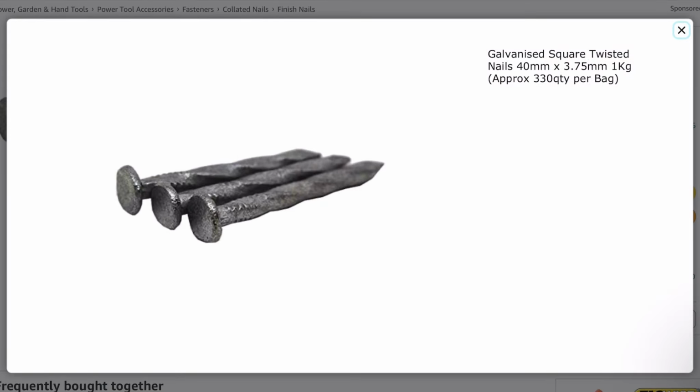The temptation is to look for easier solutions like these bracket hangers. They allow you to get the joists in place first on the frame and then slide the hanger underneath and fix it, making everything a lot faster and a lot less cumbersome on your back. However, the likelihood of you getting squeaky joists is much higher with this hanger, and I don't know why you would compromise on something so important as using a decking hanger when you should be using proper joist hangers.